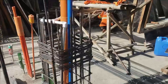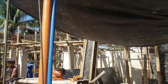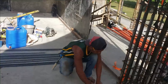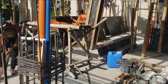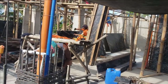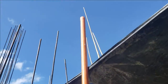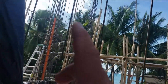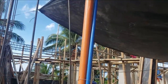And we have one other vent stack. This one in the middle here is also a vent stack, and we extended it up already because I was afraid that maybe Mott was going to faint. I didn't want Mott to pass out breathing that tube right there. It was a poison gas, boy. Because it is active right now, all the way to the septic tank. Something you don't see a whole lot of in this country is vent stacks being put in. Very important, though. Very important.